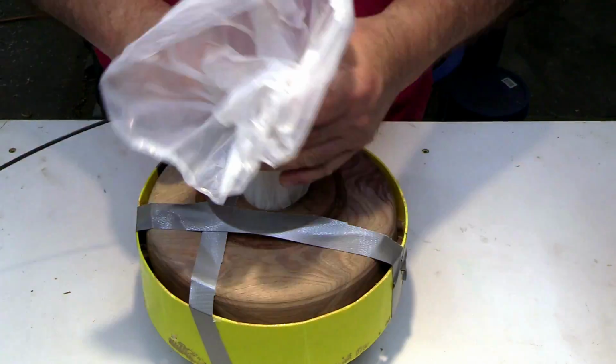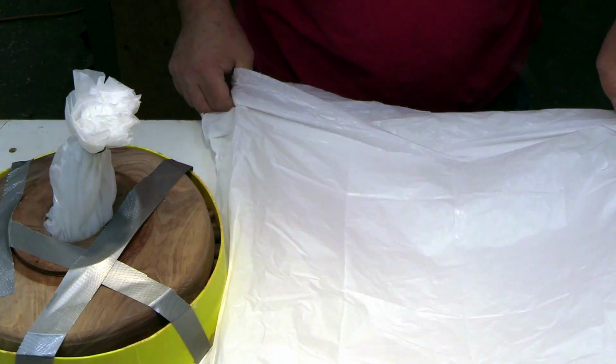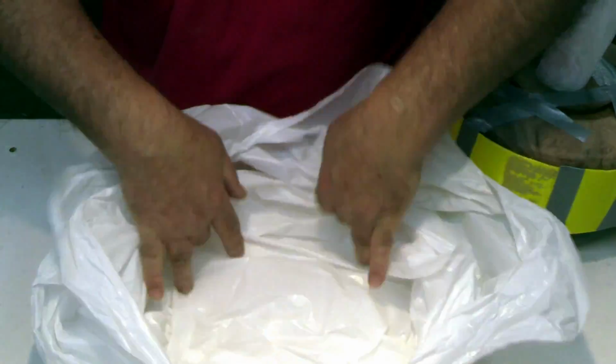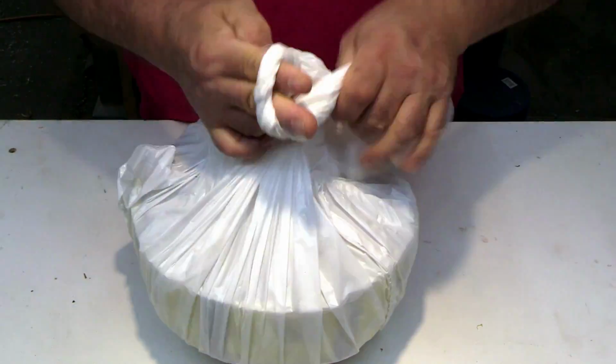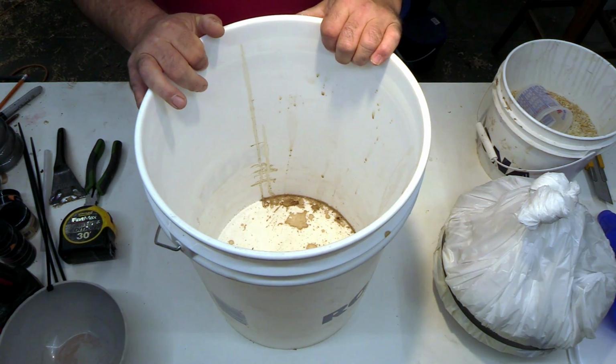All of these cable ties you see me put on these, I don't really put them on real tight because I plan on putting this piece into the pressure pot. That way any trapped air that's in the casting can move freely. Gonna have to use a deep bucket on this one.